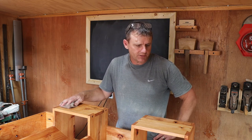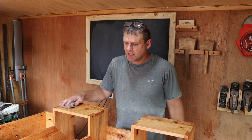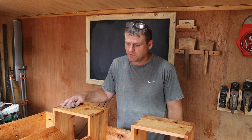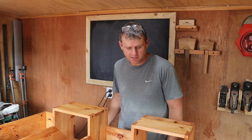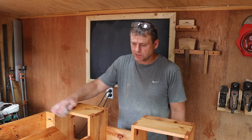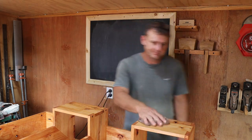We let that dry now. We'll give it a light sand with probably some 240, just take the nibs off and then give it another coat, and then that's the job done, and then we can hang it up from there. But that's looking good. Happy with that.